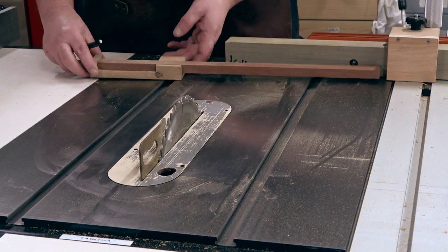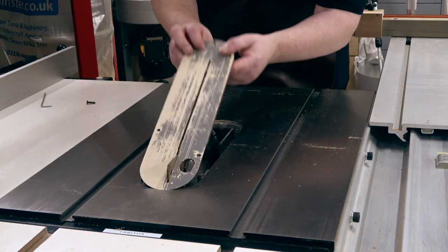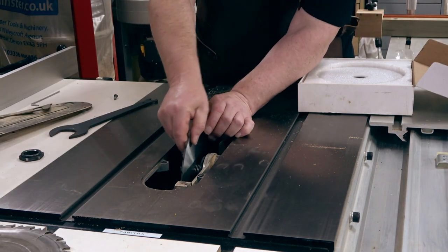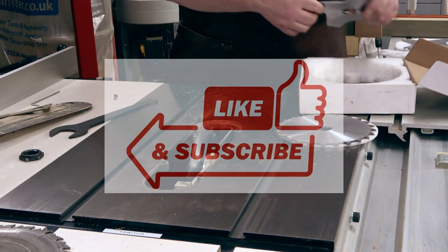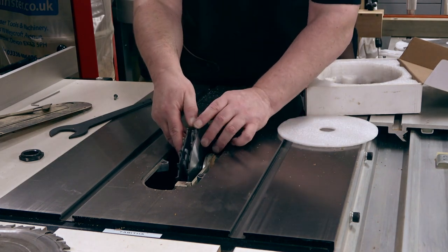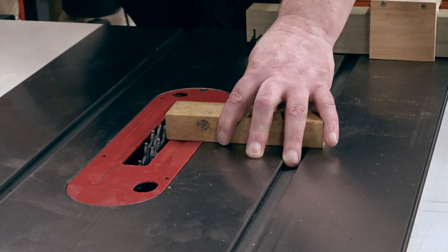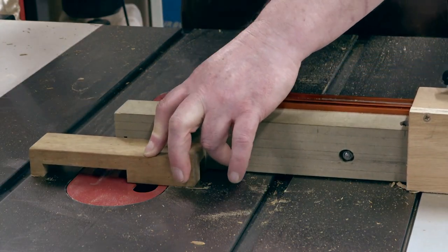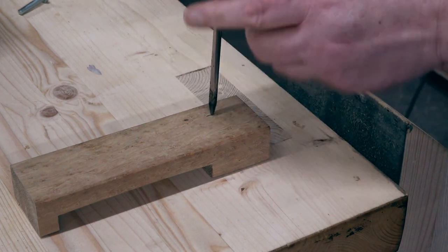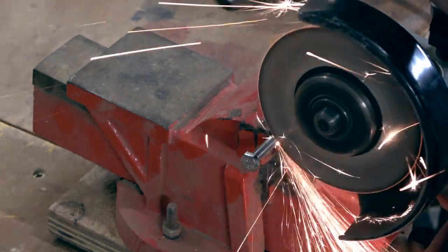We're cutting the slider down in preparation for the calibration. Then we're changing the table saw blade out and putting a dado set in — and while we're doing that, it's your job to hit that subscribe button and like. We've set the height of our dado so that it doesn't fully remove the track we've previously put in and now we're hogging out a four-and-a-half-inch throat. We've marked the hole, drilled the hole, and now we're putting the screw in the centre of the channel to hold the T-track or the slider.